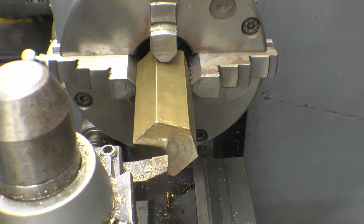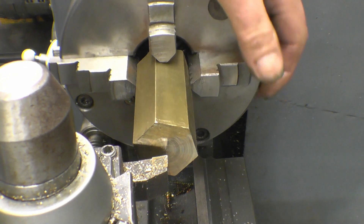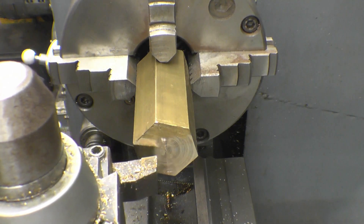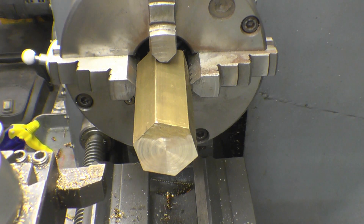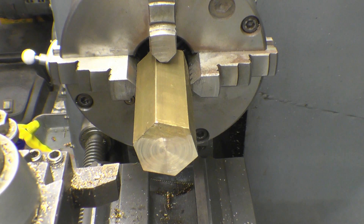There's quite a lot to come off there, so what I'll do is put a big heavy cutter on with the power feed, with the lathe running reasonably slow. It's going to be noisy because I've actually got the gearbox set up to cut the 14 TPI thread, so it's got a compound gear train in there and the gears aren't meshing as well as one would like.